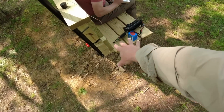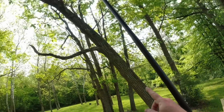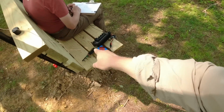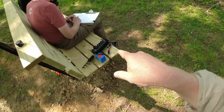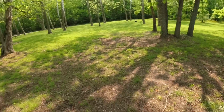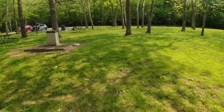But basically he has 3 counterpoises, as you can see here. I think they're 17 feet long, maybe, going in different directions. And he has one, is that a 17-foot radiator? I can't remember. No, maybe 20-some feet. He can tell me later. And he has a little balun right there. And with his KX3 running 5 watts. He's like me, he never runs over 5 watts to activate a park. It's a little easier to use earphones on a day like today. But it looks like he's gonna hop down to 40 meters now and he'll make the rest of his activation. No problem at all.